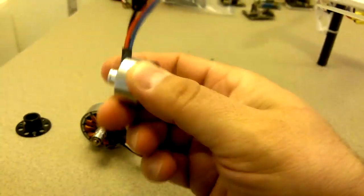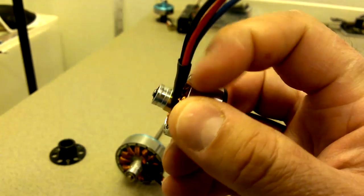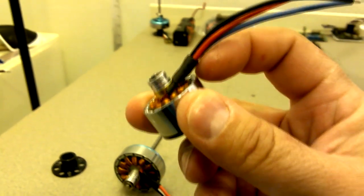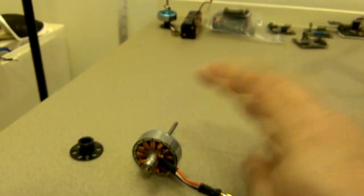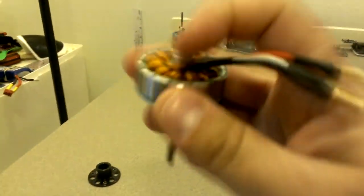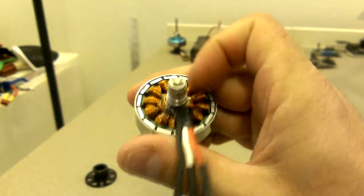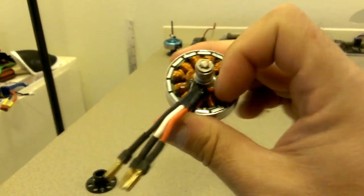These motors also have a problem that many, or maybe all, bell-type motors have. If you look right here — I've got a spare one — the wires going in are very, very delicate. As you get vibrations, you can eventually break these wires. So what you have to do is mix up some epoxy and pack it in there to glue the wires to the windings. I've got an example of that on this DT-700 motor — same style motor, much bigger — and I've got the wires glued down, so vibration is not going to hurt that at all. The only thing that spins is the can, so make sure you don't get the glue on the magnets or where the prop mount goes. But you can cake the glue in there and it's not going to hurt anything. I've done that to all four motors.